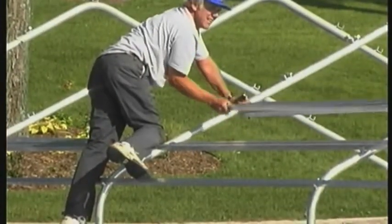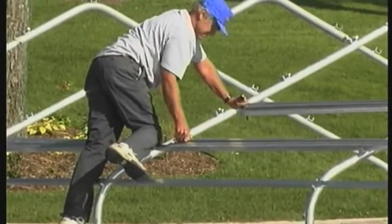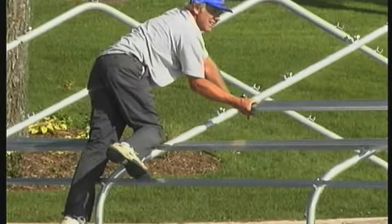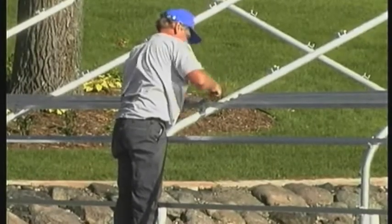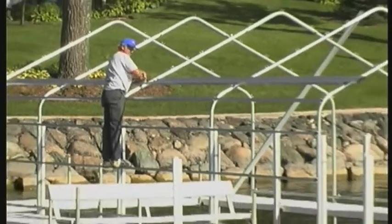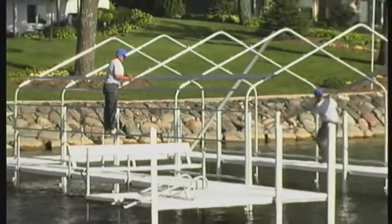Remove the slats from the top working down. First remove the two over the crown on the covered walkway side, then proceed down the side you came up. The slats should be in piles of no more than 6 of the 16-foot slats. When reaching the vertical slats, stand with your weight pushing in on the slats. For your own safety, do not push outward as this could cause the slats to slip out.